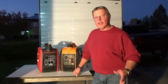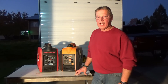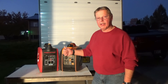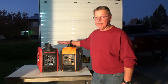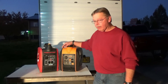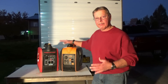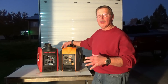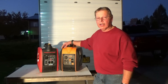Let's have our conclusions. Both of these generators handle just fine in a short, small boondocking situation — they'll handle a small heater, a small air conditioner, a refrigerator, and a microwave. In a pinch, I wouldn't recommend running the microwave and small heater at the same time full time; the overload lights did flicker. But we still had power going into the system and things were operating basically normal, so we were at the peak of their limit. If one more thing had kicked on — like the refrigerator compressor — I think these things would have shut down.